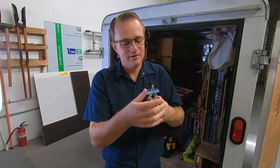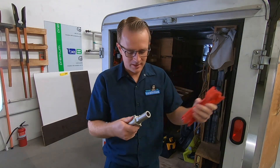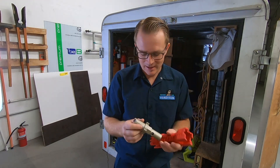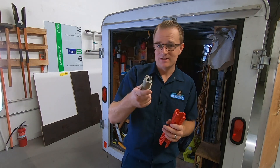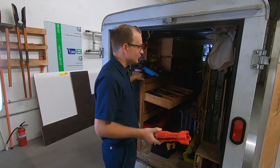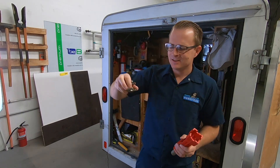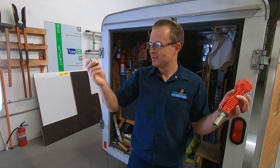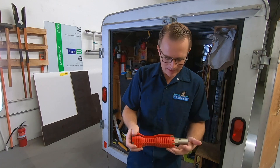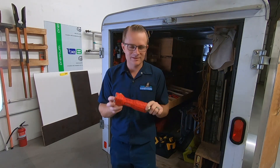It's also got a place where you can hook in a 3/8-inch drive ratchet to get more torque. It's got a hex head to tighten up certain types of faucets, and a drain nut feature to help you do drains, basins, and things like that. It's a really diverse tool, but the thing I use most is this little cube — the three-eighths and half-inch end. It makes it really easy to tighten and loosen supply lines.